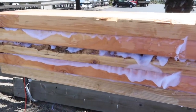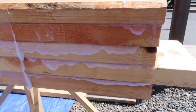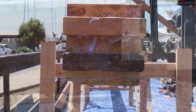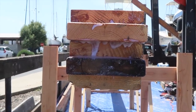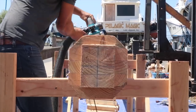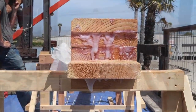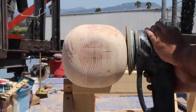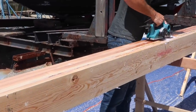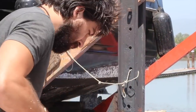We oriented each individual board so that any imperfections would be shaped or cut off. The bottom end is getting the most removed and a peg will be cut out, which will sit into the mast step through the deck. The top end will be trimmed and then routed down to round. We might not have any electrical run up to the masthead — since we're a traditional rig, most things can be run up the shrouds.